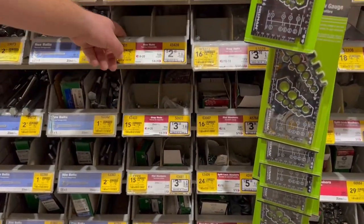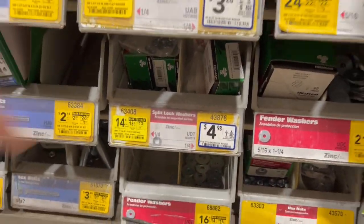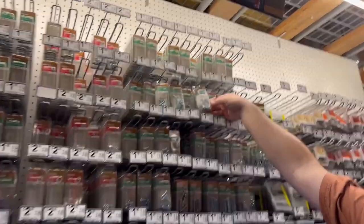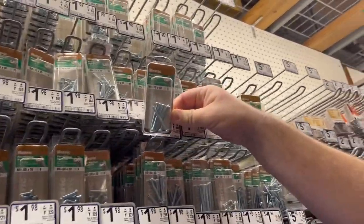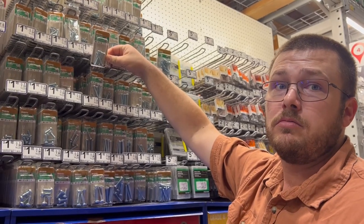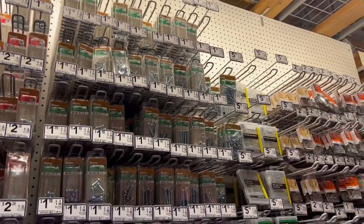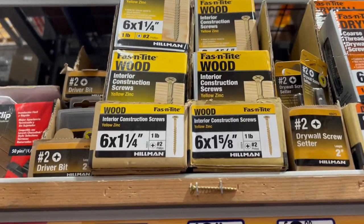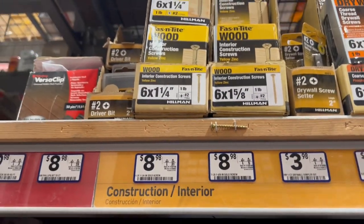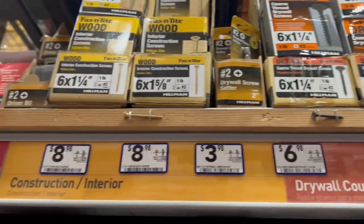There will also be a section with washers, and down here there are quarter-inch washers. Over in the metric section, we're looking for M4 by 40 — this is specifically for her projector, which is an Epson Ultra Short Throw. Your different brand might have a different size, but all of the Epsons I've used so far have had that same screw size. You can just Google your model projector and it'll tell you what size screws in the owner's manual. Then you need wood screws — six by inch and a quarter will work just fine. Make sure they are wood screws, not something like drywall screws.